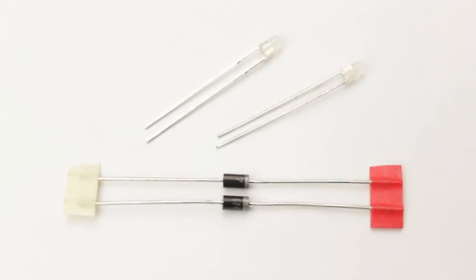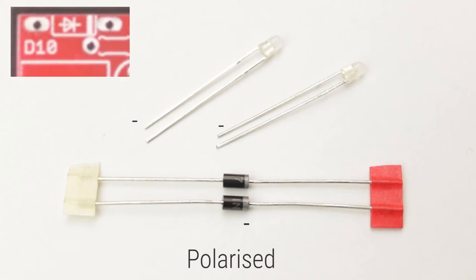Here we have two types of diode. The black one with the grey band is a common Schottky diode, and the other is a light emitting diode, or LED. Diodes are semiconductors and hence only allow current to flow in one direction, so diodes are polarised. The negative side of a standard diode is denoted by the grey band — sometimes you'll have an orange background with a black band, but it is the side with the band that identifies the negative side. On the LED, just like with the electrolytic capacitor, we have a short and a long leg, with the short leg being negative. On the silk screen of the PCB, the correct orientation of the diode will be indicated by a corresponding band, sometimes with a little triangle pointing towards it. For LEDs, there will generally be a plus or minus symbol to indicate the polarity.